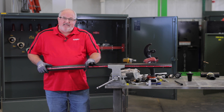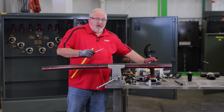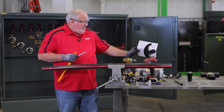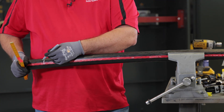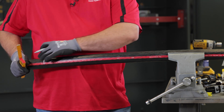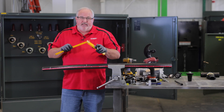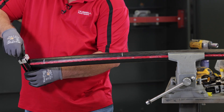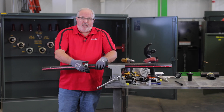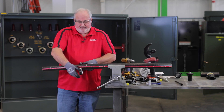A lot of these tools are very precise and they don't like bends in the cable, so we want to make sure that we keep the cable as straight as possible for good success with our cable prep. All the T-body kits come with instruction sheets, so we're going to go through the instruction sheet. This mark is where we need to measure down 14 and three-quarters inches, and we're going to remove the jacket and expose the concentric neutrals. So now I'm going to make a square cut here, spiral off, and remove my jacket.